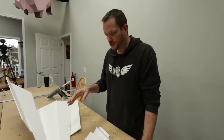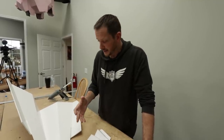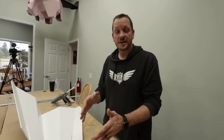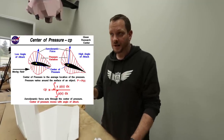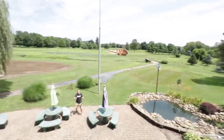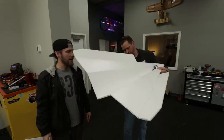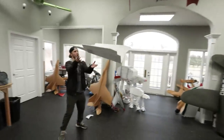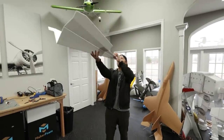My 'plane that flies long' is pretty much ready for a glide test. We do glide tests to find the center of gravity - that's where the plane balances and where the center of pressure is located. When you find that, the plane flies farthest. Before any project, whether simple or a flying battleship, we often make a small scale one and glide it to find the center of gravity. Once you know that, all your electronics placement can ensure the plane balances without adding extra weight. This is also where foam paper cuts are born - I've seen gashes the size of Texas.